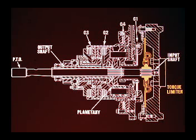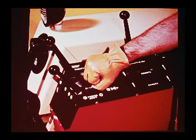The input shaft is spline coupled to and driven by the spring-cushioned hub of the torque limiter plate. The output shaft speed is determined by the engaged clutch combinations, which control the input to output speed ratios through the planetary assembly. The selector lever on the operator's console is used to select the engaged clutch combinations for each speed selection. A combination of 2 clutches must be engaged for a completed drivetrain.